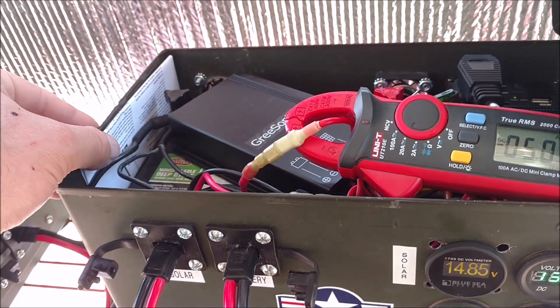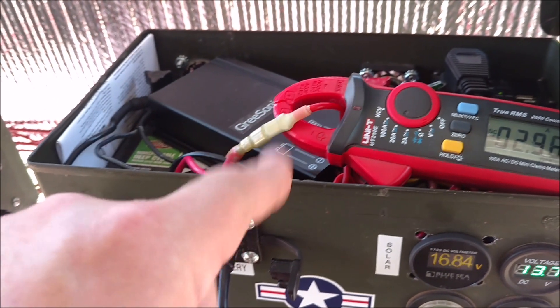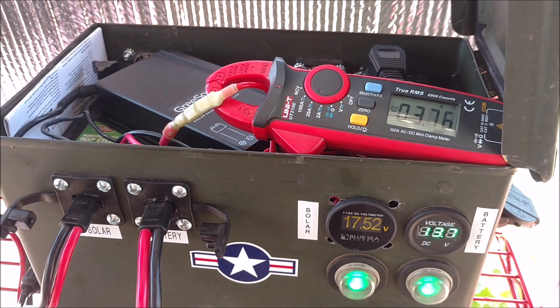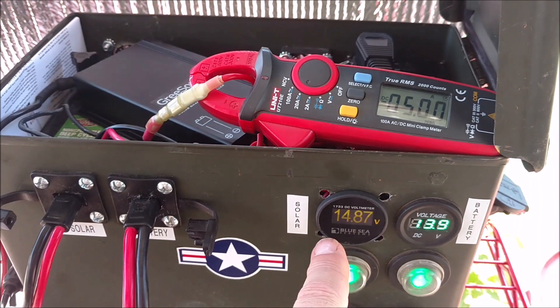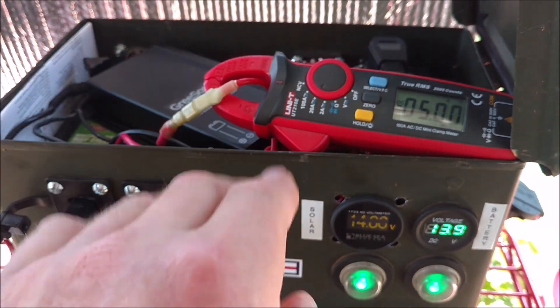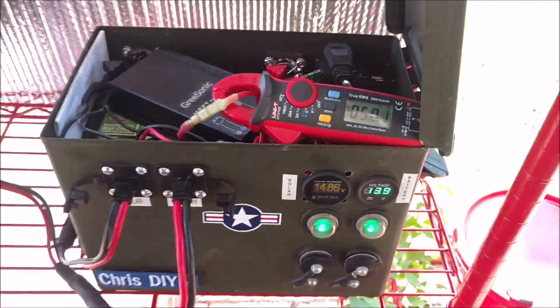I put the instruction manual right here, just kind of tucked it in. The fast blinking light here indicates that it's in MPPT function — see, watch, see there. It's actually making more power at lower voltage; it's hunting around for the highest current. That is slick.